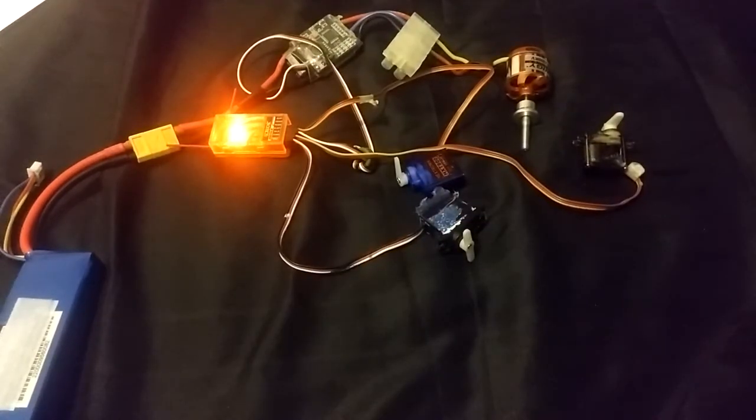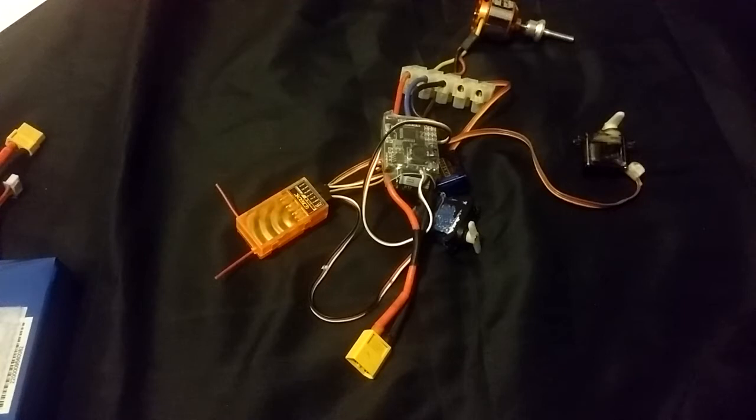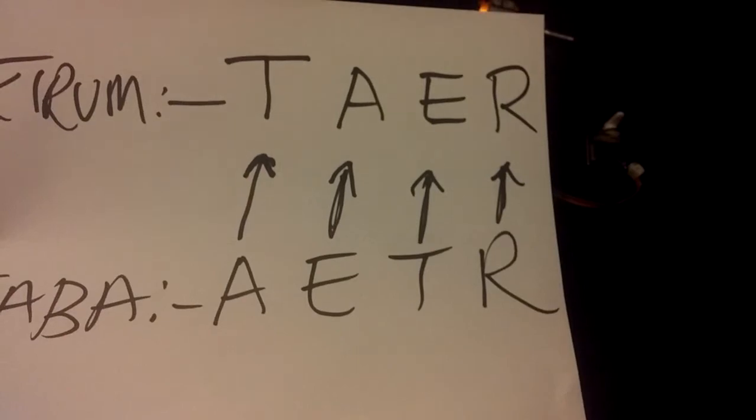It's almost as easy as that to solve. As I said, this formula works for Spectrum, Orange RX, and Lemon RX receivers — a very cost-effective way of solving that issue. It has had a lot of very negative reviews and I just wanted to sort that out. To be very frank, as a conclusion: is this unit perfect? No, it isn't. Could it have been done better? Yes — it wouldn't have taken much to update it so the channels automatically relate to Futaba. But that hasn't happened. For 25 pounds or $30, it's still a very cost-effective way of getting Spectrum onto your Futaba transmitter, as long as you remember how to plug in the channels. Plug them like this and your model will work flawlessly.